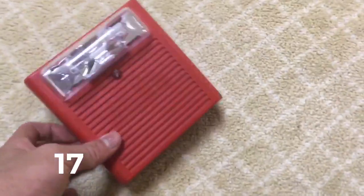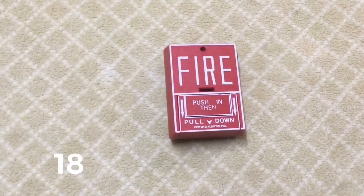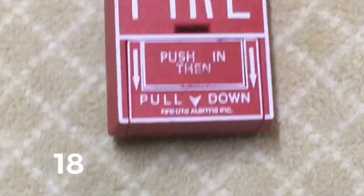Some Wheelock strobes are actually not acceptable for use on ceilings because of this tab on the top that prevents the light from going out in all 4 directions. The BG10 actually was recalled because of the button seal inside failing, not because of the screw on the top or the pull lever.